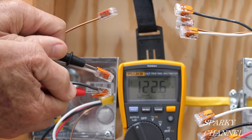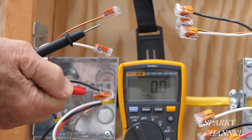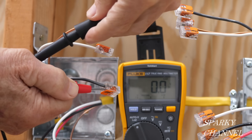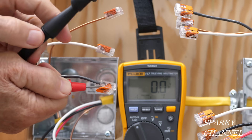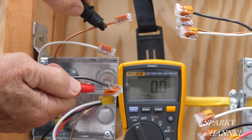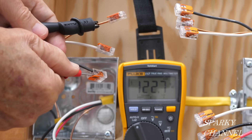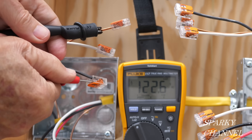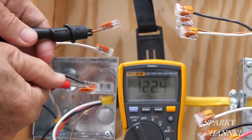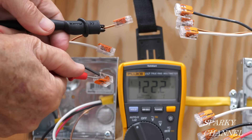If you do all this wiring and then find out you have bad voltage, you just wasted a bunch of time, so it's always a good idea to check. 122.5 is an excellent strong voltage. I'm going to put an alligator clip on my black lead, put that on the ground — we've got 122.6 — so this shows me that we have an excellent return path to ground and a good ground in this system.